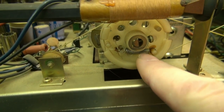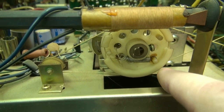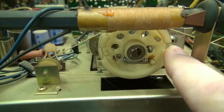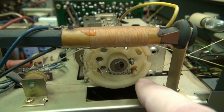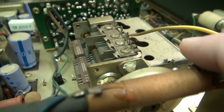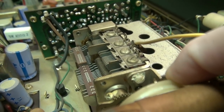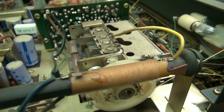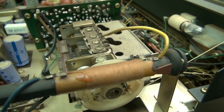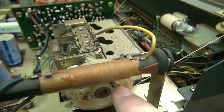Right here is the tensioning device to keep that cord nice and taut so you develop enough torque to tune the cap. One thing you always want to do before you do one of these tasks is make sure that the tuning cap moves. Because if that guy's locked up, you might as well stop — you're going to put on the new cord and it's not going to work. There's no way to fix these things; pretty much when they lock up, it's curtains.